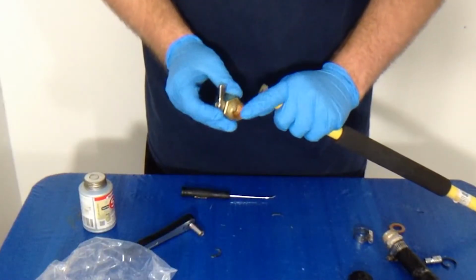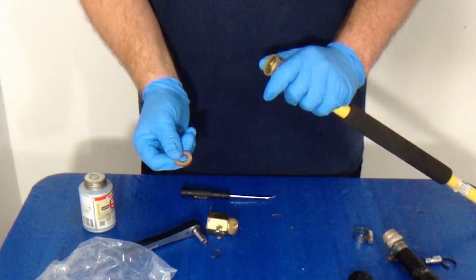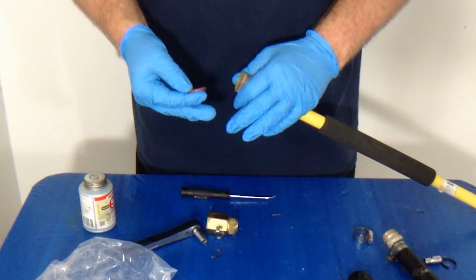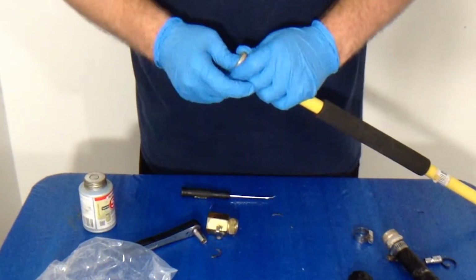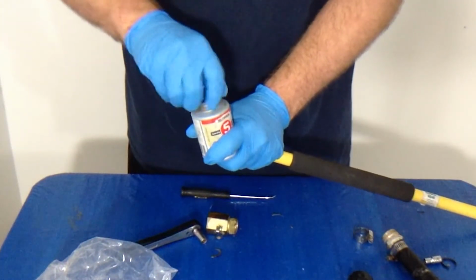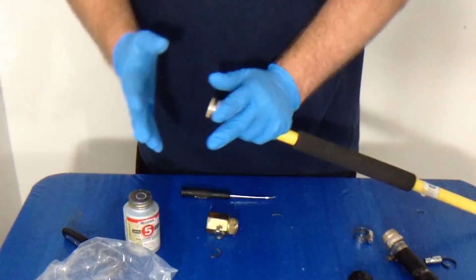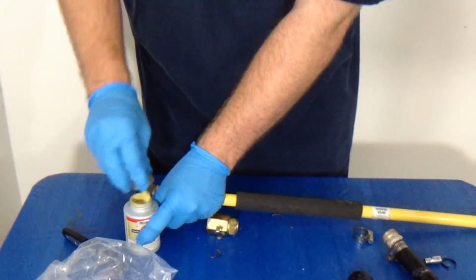A lot of people have it leak out of here. Replace that crappy vinyl one with the rubber ones. You probably won't find them in the garden section. If you don't find them there, look in the plumbing section, particularly next to the washing machine hoses. The vinyl ones are just crap. Even though this is garden hose thread, GHT, rather than NPT, National Pipe Thread, which is a tapered thread.